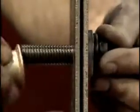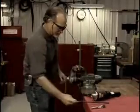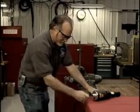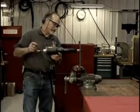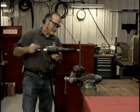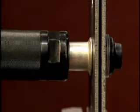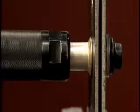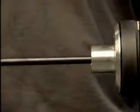Insert the pin into the pre-drilled hole. Spin the collar with a flange base towards the work surface. Insert the ratchet rod through the tool. Place the tool at the end of the fastener. Turn the ratchet, threading the tool onto the pin. Stopping approximately 1/8 of an inch above the collar, and then remove the rod.